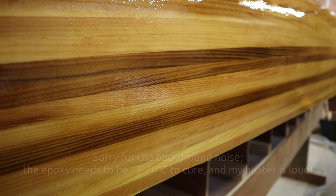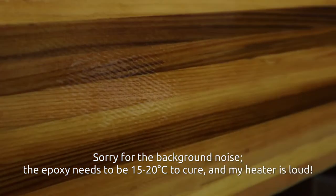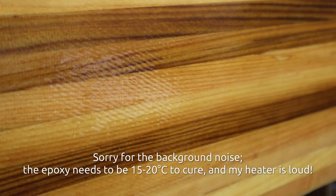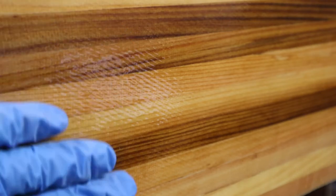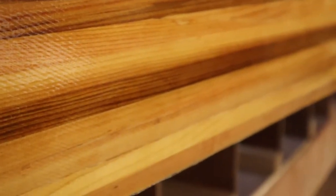There's one area on the side of the canoe just here where the third layer of epoxy just wasn't quite thick enough. I don't know if I missed it completely or if it's just not wetted out quite enough, but the weave of the fabric is still very visible here and very obvious when you feel the boat. Additionally, along the shear line that area has extended out a little bit and there are a few areas along the shear line as well which aren't great.